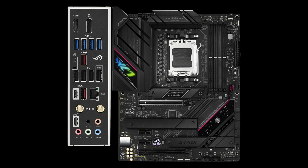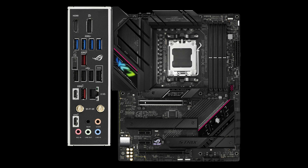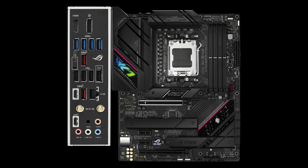Next comes the Strix F. Compared to the Riptide, the V-core phases are reduced by one, but in turn the power stages are rated for 20A more. On the PCIe side, this board upgrades the previous PCIe 3 x16 slot to Gen 4, doubles the PCIe 4 x1 slots, and replaces the M.2 PCIe 3 x2 socket with a Gen 4 at full bandwidth. As for the headers, it adds one fan — though none at 2A — gains a second USB 2 header, but downgrades the USB 3.2 Gen 2x2 Type-C to Gen 2.